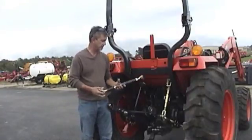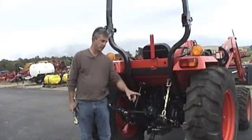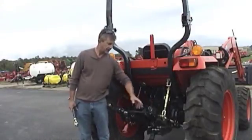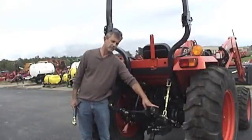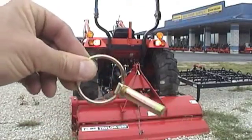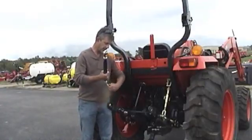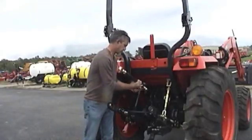What this does — this hooks in the back of the tractor. Most of your implements have two pins that stick out from the bottom, and these lower link arms, which is what these lower parts are called, go around those pins. Then they're linked to those pins with what you call the lynch pin. You put that around the implement. This top link goes in the back of the tractor, like so.